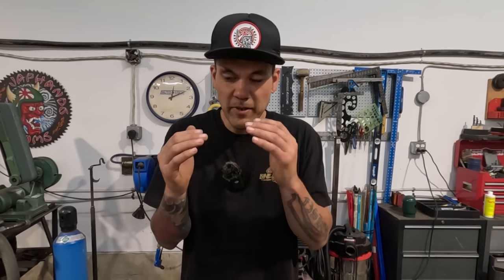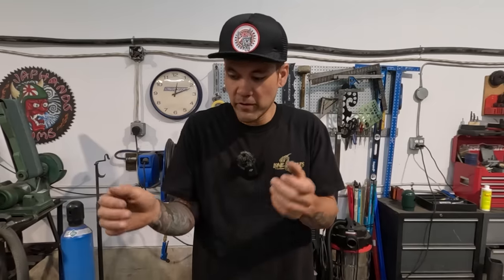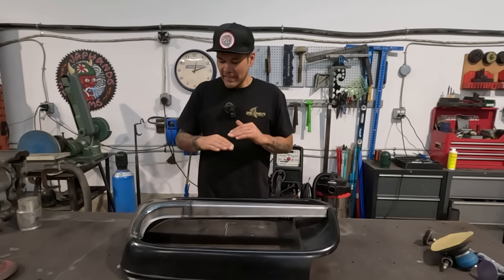And that soft material that got squished into the colder material doesn't relax back out because that happened. So that's where the shrink comes from. You've welded and expanded and heated to the point where it compressed some of that metal permanently into the cooler material around it. And then once it cools back down, that material is not there anymore, right? It's been compressed into the material around it. That's why shrinking happens.